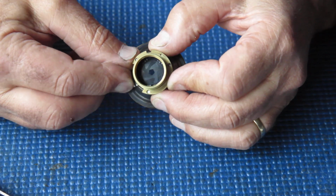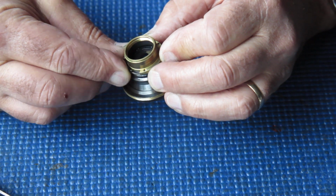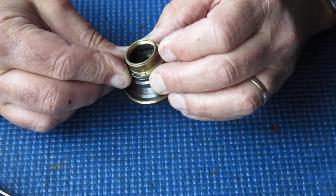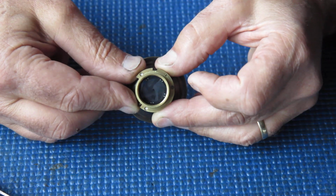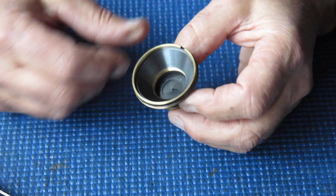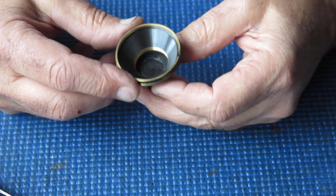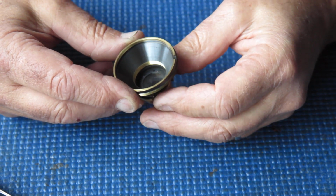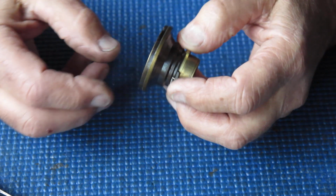At the back we see the diaphragm here, and I'm looking at the state of that. There's five positions there, but there's probably actually 10 blades in there. They've got multiple sections on these typically. They're quite delicate. I suggest you don't take that apart. If there's a problem with it, swab it very carefully with the likes of naphtha. If the blades are stuck together, either because of the oil on them or because of naphtha, do not force them. You'll end up damaging something. So that's our lens capsule.